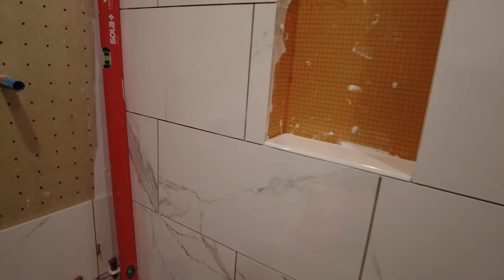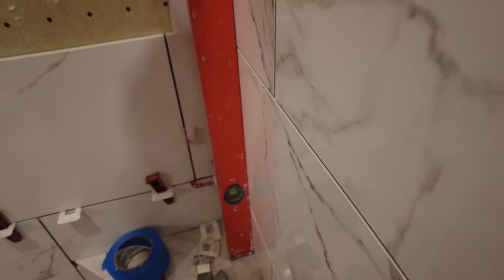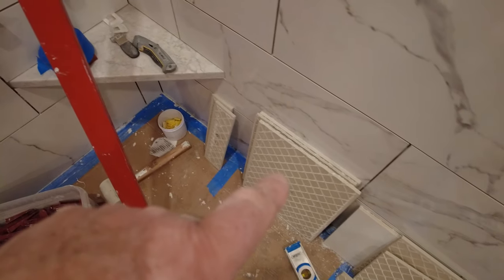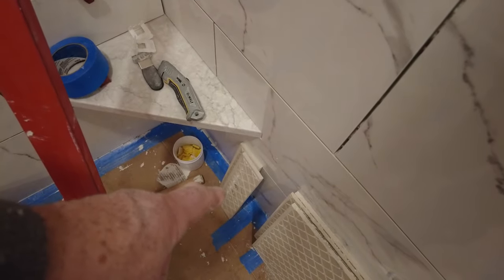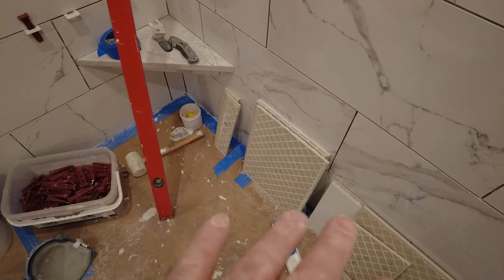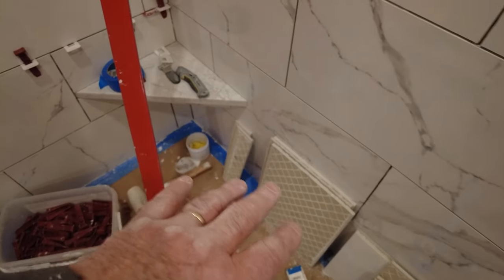This is why it's very important that your walls be perfectly flat and perfectly plumb. All perfectly flat. That way you can pre-cut your tiles — these are all the same size. The larger ones are for this corner here and the small ones are for this corner here, so they're all pre-cut so I don't have to worry about trying to figure out what they are. I can just start in the corner and go.